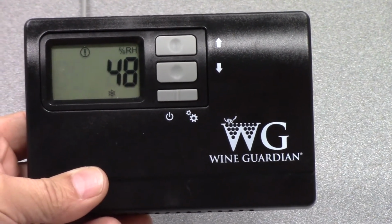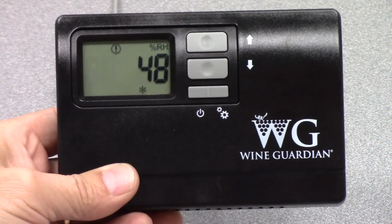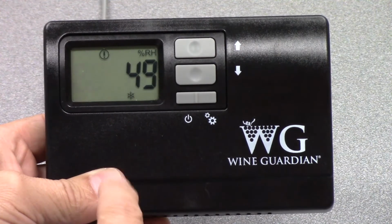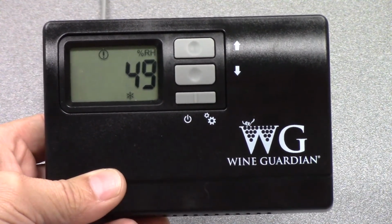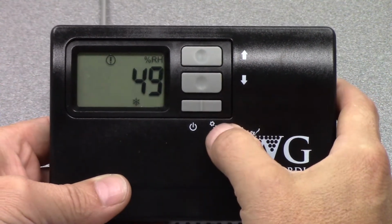And it's setting number 6, which you have to change. Again, I'll show you that once we get into the setup screen. But it will only allow you to change relative humidity if you've changed setting 6 to 1, which recognizes that there's a humidifier connected to the device.